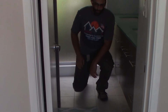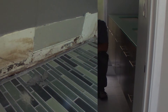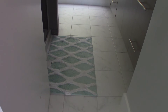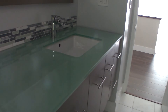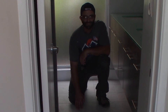This bathroom originally had mosaic-style glass tiles on the floor, gaps in the corners, some dry rot in some areas, and the base molding was moist — so we went ahead and replaced it with all new base molding. The tile has been placed. We ended up using quarter-inch hardie, and the reason was we wanted to bring it to roughly the same height as the existing floor, and that worked out pretty good. We also put a backsplash on top of the countertop here. The flooring is done and the clients are happy. Until next time, happy renovation.